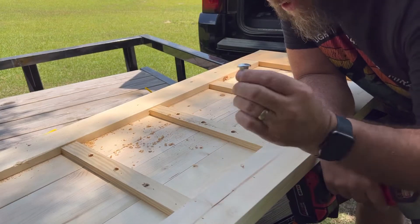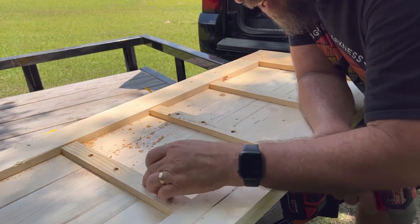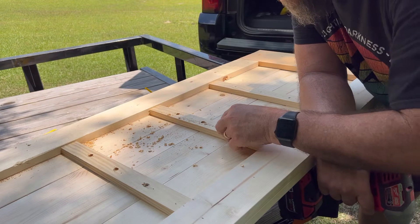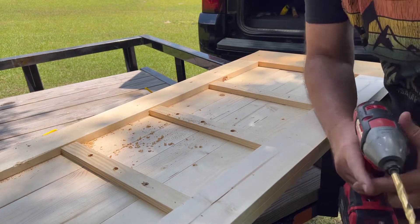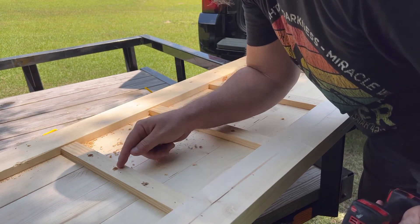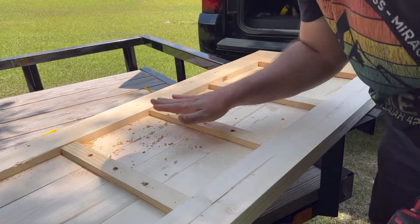Where this one's a little different — we're going to drill holes and put bolts right in here, but we're going to paint the tips of them black because the shutter is going to be white. These are just for looks; they're not holding anything. After we paint them and they dry, we'll take a mallet and knock them in to give it a more rustic look. The spacing: come down three-quarters of an inch to the middle of the board, then three and a half inches over and drill three holes, doing three, three, and three all the way up.